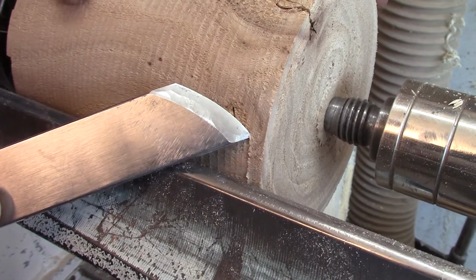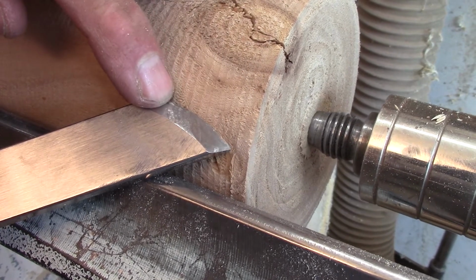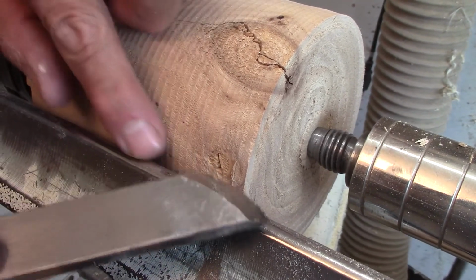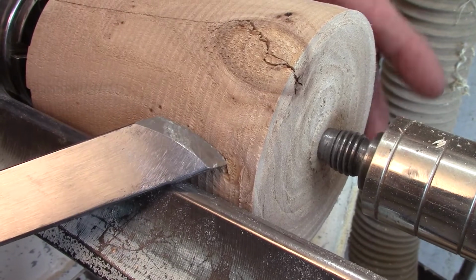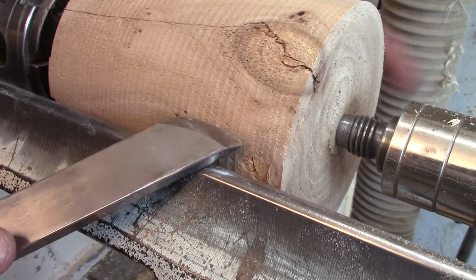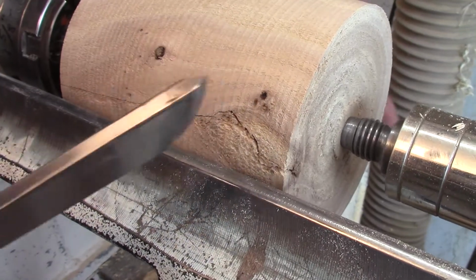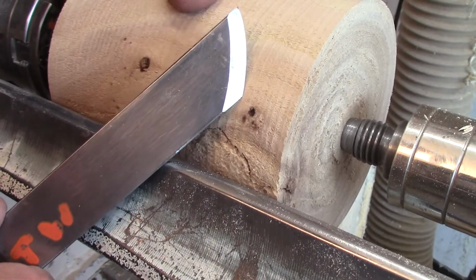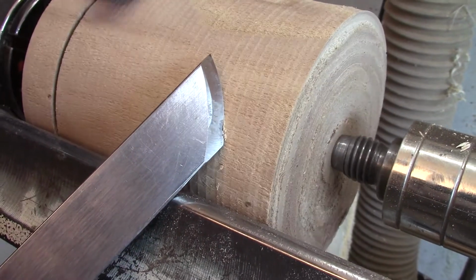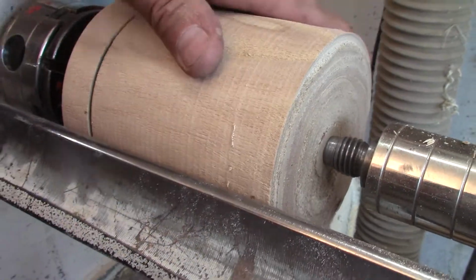And if I drift over and move like this and it starts to engage here, it's got that whole piece in contact and it's going to snap this down. If you've ever had this happen, you'll understand what I mean when I say it's going to create some screw threads. It just rips off very, very fast, and you get kind of a circular groove in the wood. The same thing happens this way. Now I'm in contact with the wood, and I'm cutting. As I drift back here, boom, I snap down. I'll show you that with the lathe actually running.